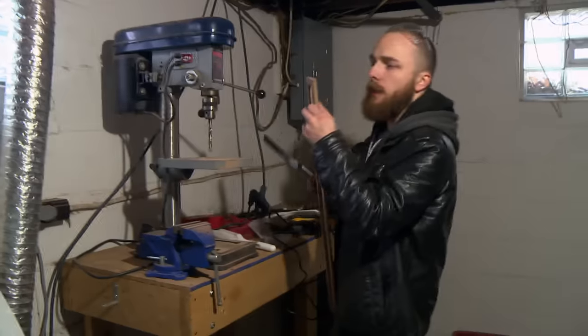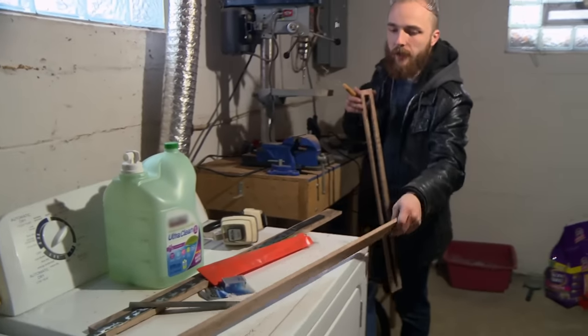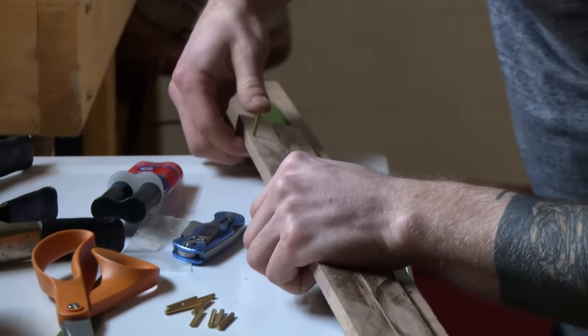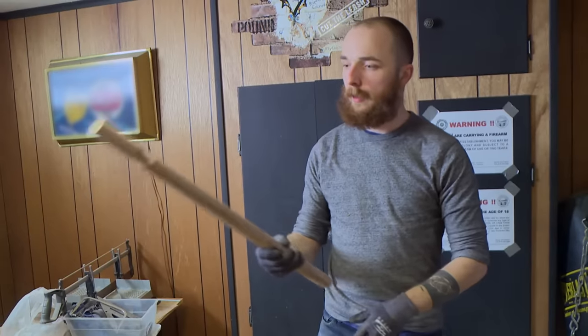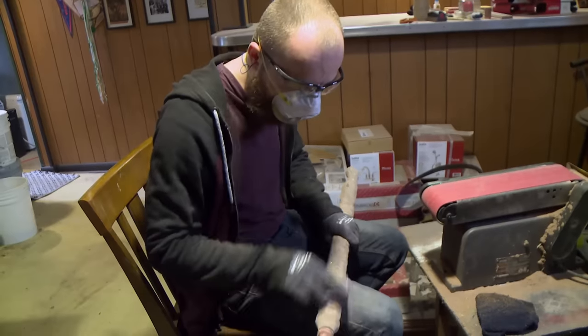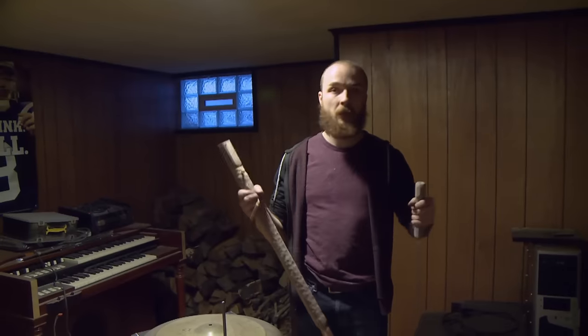I've never made a cane before, so today I want to spend a whole day dedicated to it. I want to make sure this cane is structurally solid in case they're going to beat on it. My cane is going to be a framed construction — this bit will be in the middle of two other slabs, kind of like this one, and it'll all be pinned together as well as a fair bit of epoxy. I'm taking my cane down from being a box to being a hexagonal shape. It's starting to really look like something other than a block of wood. I've done the texturing on my cane — it's very similar to the flint nap that we did in round two on the handles of our karambit. All that's left is a little linseed oil on all the wood parts, and I'm done.